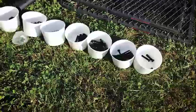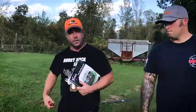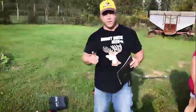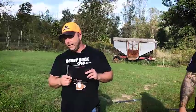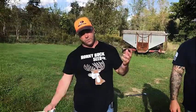So that's all separated. We like to use cordless drills and then some wrenches, sockets, but I like to go ahead and get a tape measure, because there are different size bolts as far as lengths. You got 1¼ inches, 1¾ inches, 1½ inches. I can't tell a quarter inch difference. One thing you don't want to do is get it all together and all of a sudden your last bolt's too short and you got to find out which one you used in the wrong spot. So make sure you use all the bolts.